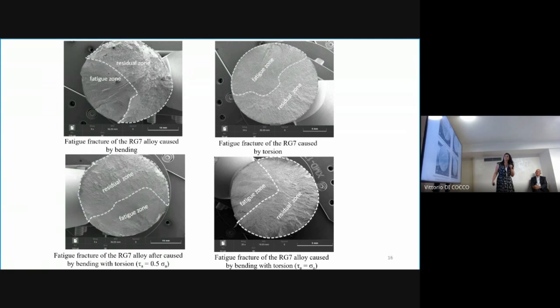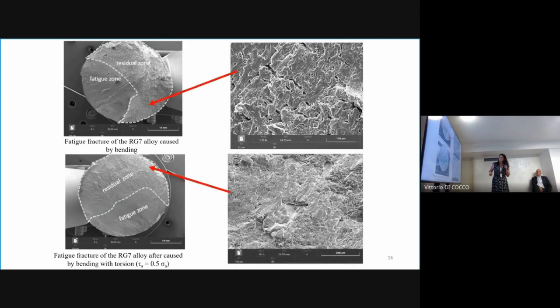Now the cyclic fracture for bronze. The observation confirms the generally known mechanics of fatigue failure occurring during cyclic torsion and bending. We can see the crack initiation and cyclic zone in each case, and the residual zone, which occupies most of the surface. A major part of the sample in the residual zone is a plastic fracture of a very fine structure.